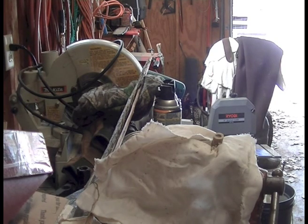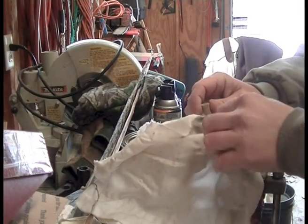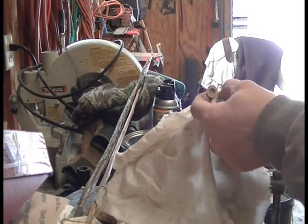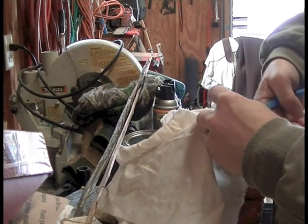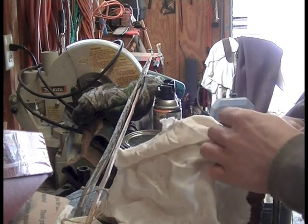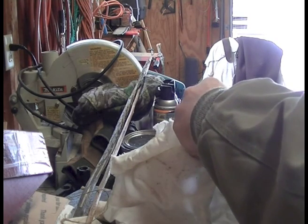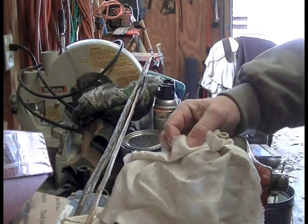Another method, if you're having trouble seeing where the drill bit should go, would be to take a pair of channel locks and hold on to it, because when it's in your hand, you have a little more of a feel for it. Actually, I used to just hold them all the time, even just with my hands and not the channel locks. But you can peel this away and eyeball it a little bit. I'm going to put mine in my vise just because I feel semi-confident I can do this. I've been doing quite a few of them, and hopefully I can line it up fairly decent.